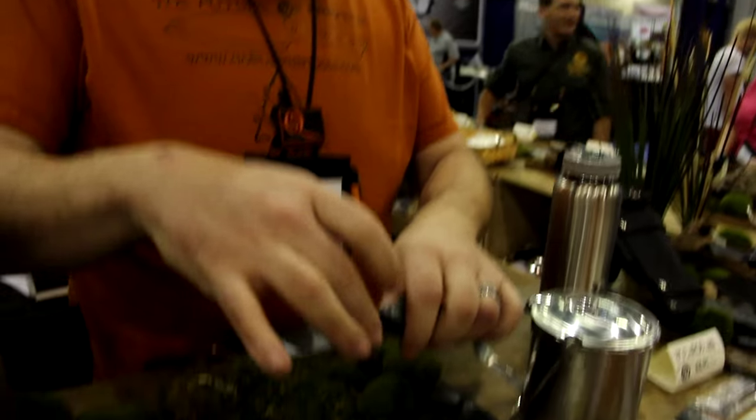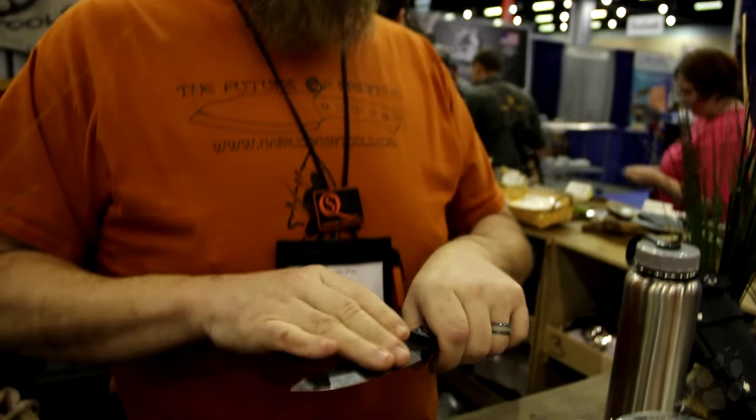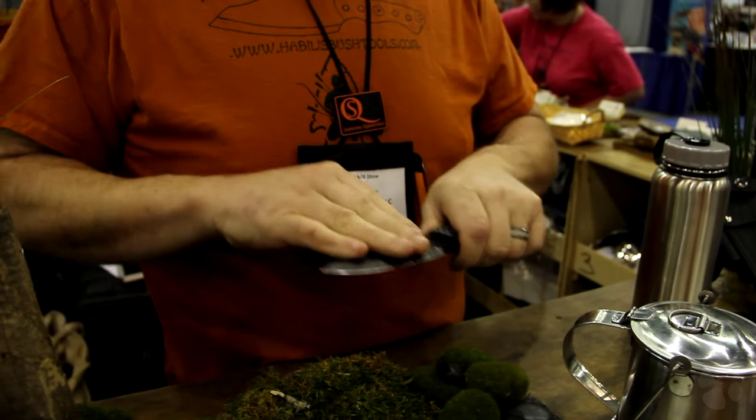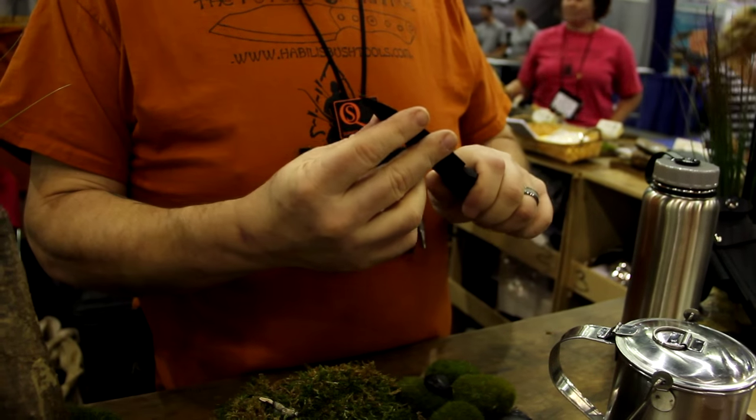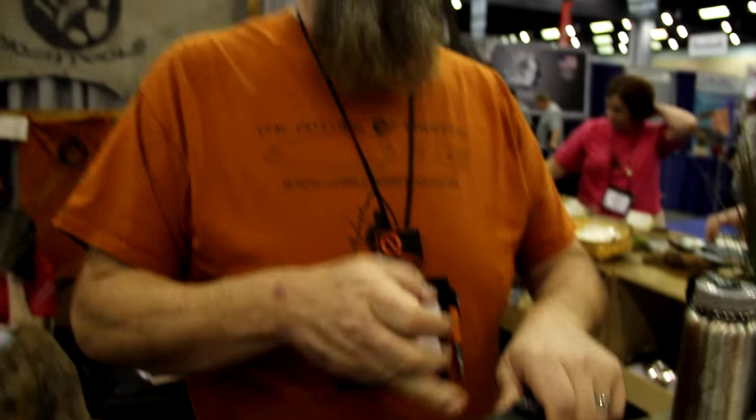The other thing that we love about pseudo Scandi versus a traditional Scandi or most other grinds is that after you've sharpened this with your secondary bevel so many times, you've changed your dynamics. Yeah. But you can put this back on a flat rock and sharpen it just like a traditional Scandi, put your secondary edge back on, and you can basically use this knife until it's gone. Yeah. And the same is true with the Bushtools, or with a lot of knives, the further you go, there's just no way to reclaim that knife. Once it gets to a certain point, it's no longer maintainable.